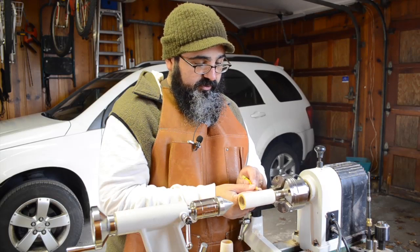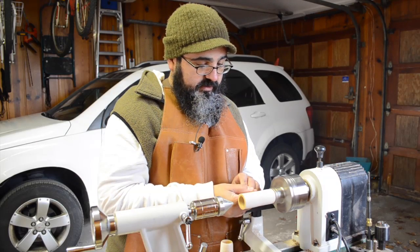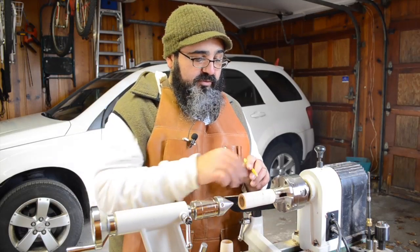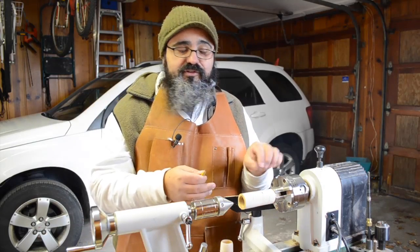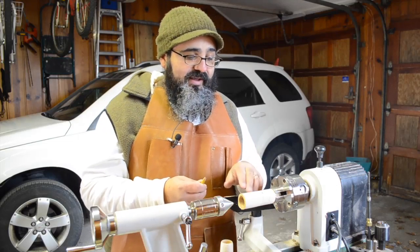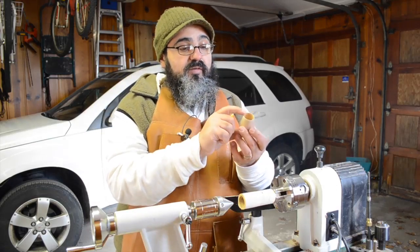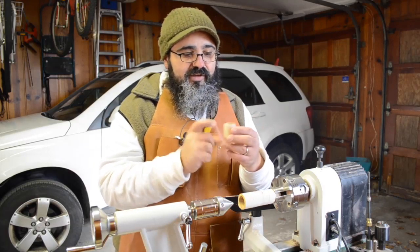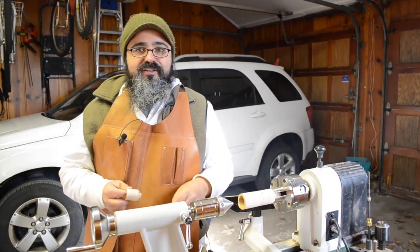Let's make our pencil mark really obvious to ourselves here. That tells me exactly where I want the base. We'll come in first and create a nice little tenon or separation using our parting tool so that we can round over that bottom. Then all we really need to do up here is shape it — it has just a slight edge that comes up and that's all there is to it. Super simple project. Let's get started with that parting.